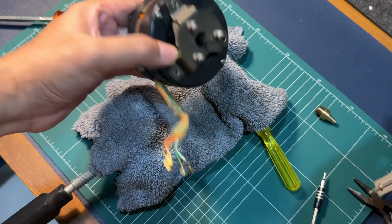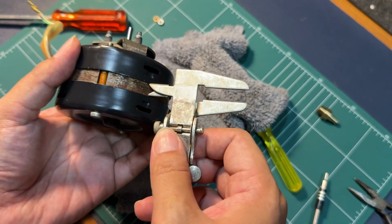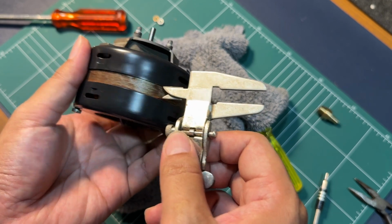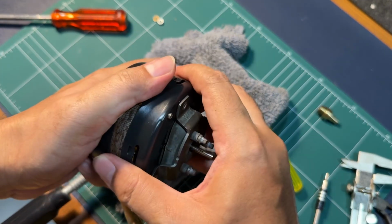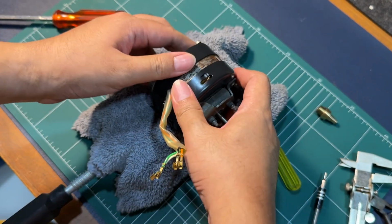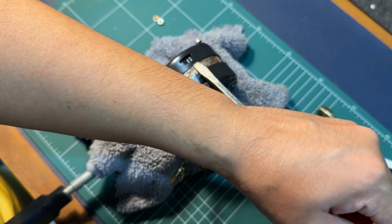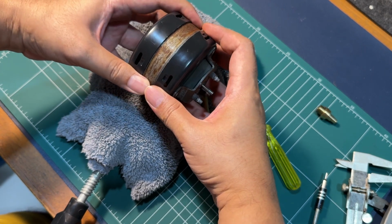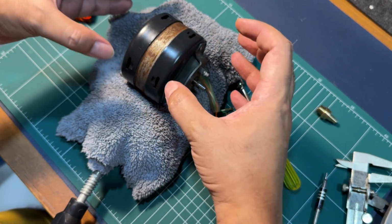And one way you want to measure your progress is you have your caliper from earlier and just check. So it has loosened up there slightly, not actually trying to hammer it open. Then we'll try with our hands, not budging yet, and then we hammer bit by bit. So we can see one side has opened. What I'm trying to do is hammer up that side so we got both of them open.